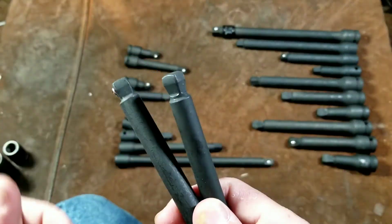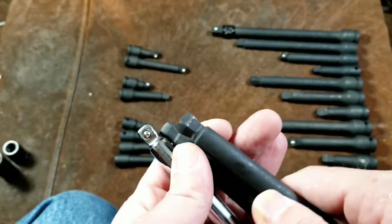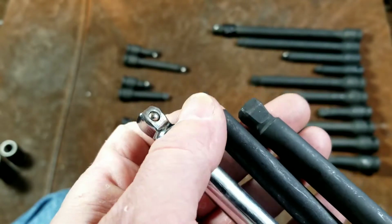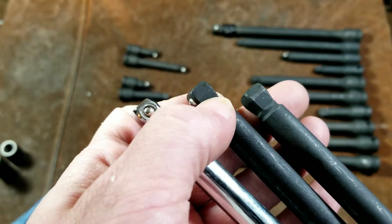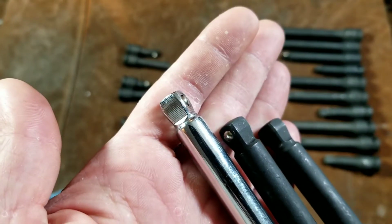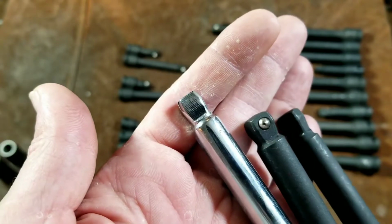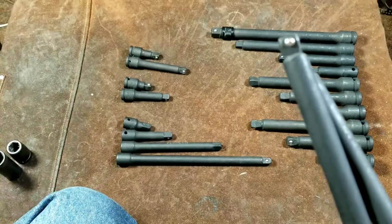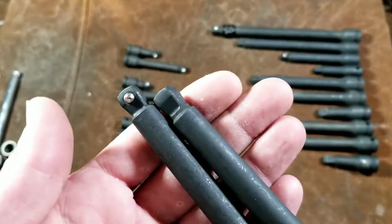The first thing about all the Harbor Freight wobble extensions is they're a little bit more simply made. They really just have 2 flats to make the trapezoid for the wobble, and a little bit nicer extension like on this Mastercraft, you'll see they'll actually machine it so it's a nice arc, and those do tend to work a little bit more smoothly. So I'll mention that the anvils are a little more cheaply made.